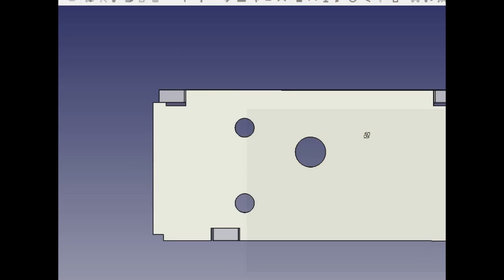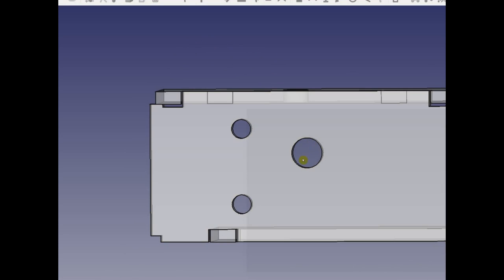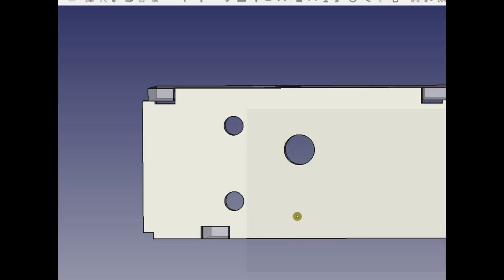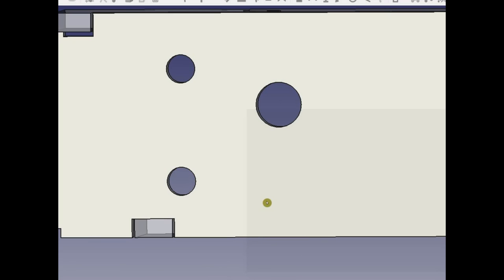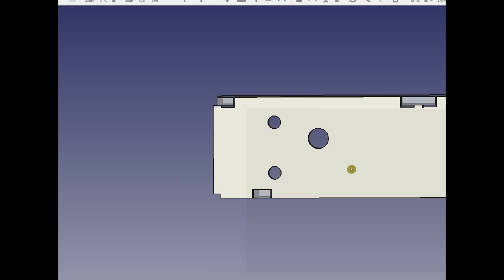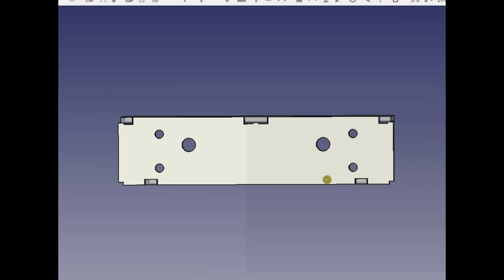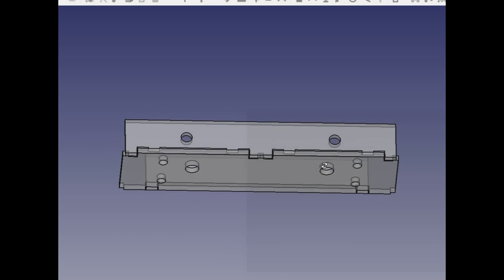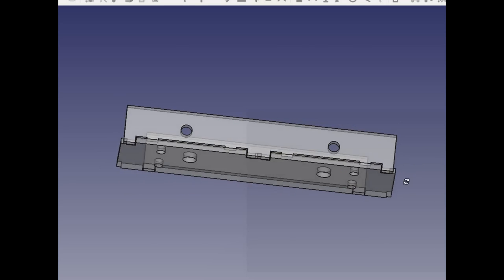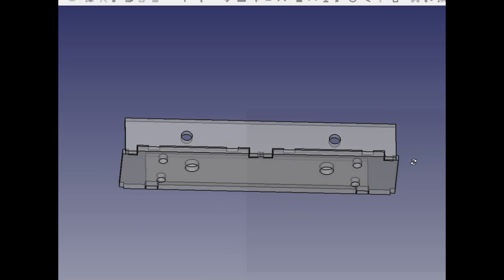extrude that half inch, so you make this flat sheet, and then don't do this hole. Put this hole all the way down. Keep these holes; they're all good. This hole moves all the way down. How far? All the way down until it can't go anymore, meaning right above the half inch above the surface there. So that's item number one, for whoever wants to do it. Let me go through all the different pieces, but basically trace it, move the hole down, extrude it, and then rebuild this whole piece. You've got to rebuild these other sides as well. That's the only way we can do it. We simply have to rebuild it from scratch. So that's a nice one solid task.